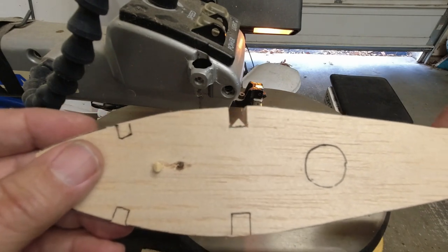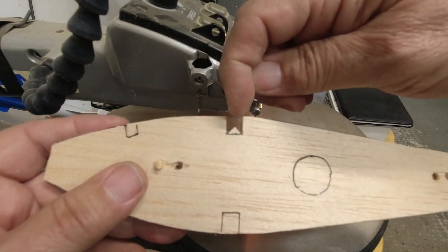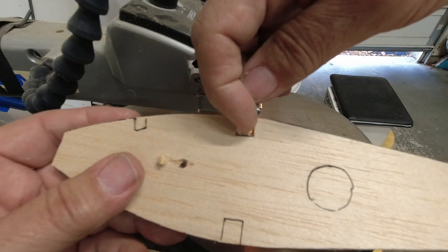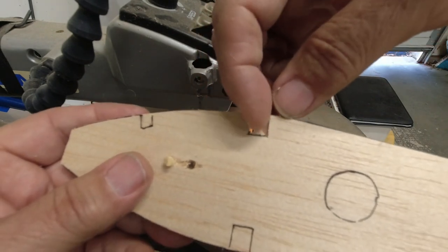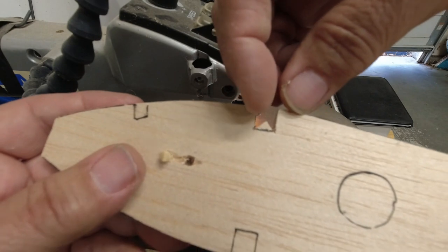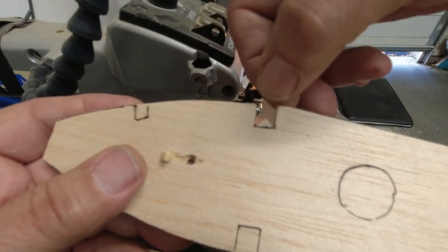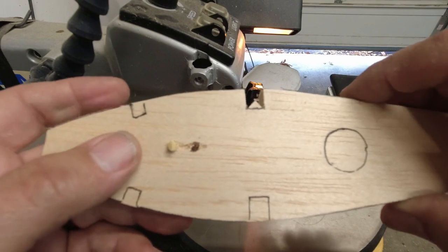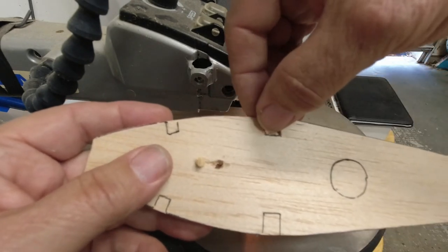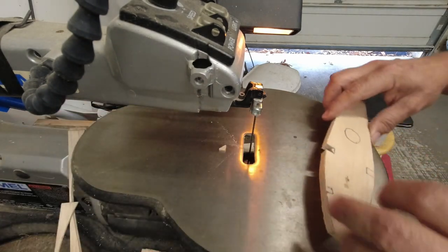We're left with this little hump down in the bottom — the lower half of that X that we cut out. What I usually like to do next is bring the saw blade down in there while it's in motion and physically turn it so it starts to peel away into this notch. Just carefully take your time — you don't want to drive down into that lower line at the bottom. Just finesse it so you burn up that bump with the turn of the saw, then make a straight-across cut to clean out the entire slot nice and clean.